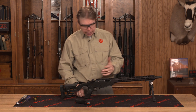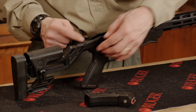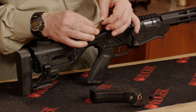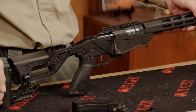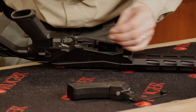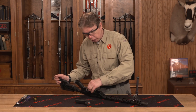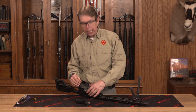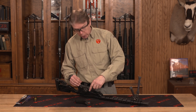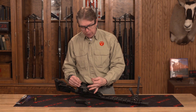The first thing I'm going to do is adjust the trigger pull. I'm going to close the bolt on my rifle. There is a cover plate that covers where our tool is located. There's a little tab on each side — get your fingers on there, lift that tab up, and down inside there is an Allen wrench in a little holder. If you flip the rifle over and open the bolt, from the bottom there is a spot just in front of the trigger guard where you can slide your Allen wrench in. Turn this to either increase or decrease your trigger pull. It allows for about six revolutions and you can go from two and a quarter to five pounds of trigger pull. Turning the screw beyond those limits does not make your trigger pull heavier or lighter — it has a limited range, but you can adjust it to the feel you're looking for.